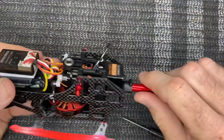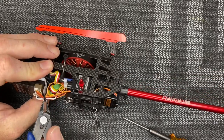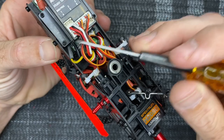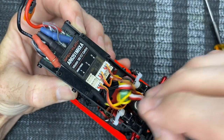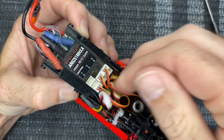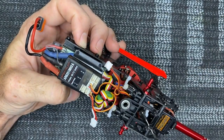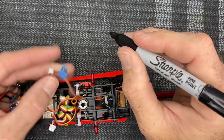Now we have our mainframe with the servos. We're going to take our cutters and cut these zip ties - be careful not to cut the actual wire. Look at your servo ports: one, two, three, and four. The first main port is throttle - that big wire is your ESC throttle. The little yellow wire is not used. Trace the servo wires: the back servo runs to port three, so label it with blue painters tape and a black sharpie.